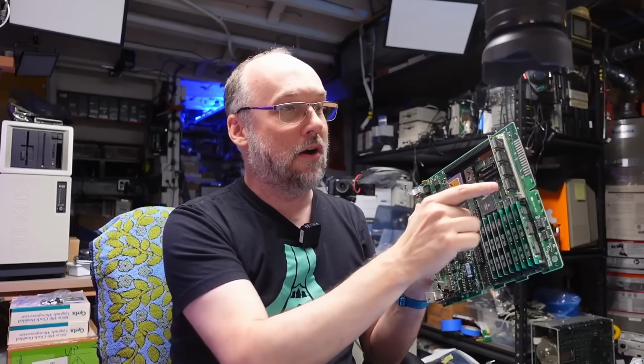The reason why we're seeing a pattern that doesn't change, and we never get the mouse pointer or that nice solid gray pattern on both of these motherboards, is exactly the same thing. They are both failing their power on self-tests, and the ROM never gets to the point where it initializes the video ROM.